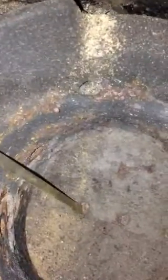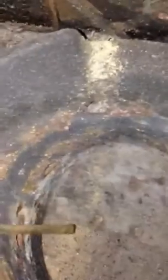And then these holes down here, it's real important to keep them clean because that's where the main air comes from, to blow air into the pellets to keep them burning right. And down on the other side of the fire pot, there's a slot at the bottom, and that's for when the igniter comes on to light the pellets.